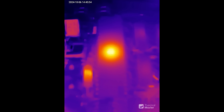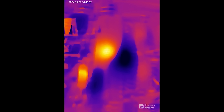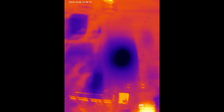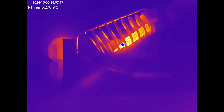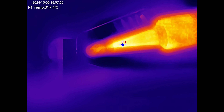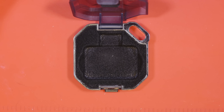A couple of strange things happened while I was testing. One: I had a bug where the camera kind of flashed and burned an image on which didn't go away — I think this is a bug that Thermal Master might want to look into. I had to unplug the camera and plug it back in again to get it to behave. Secondly, I wanted to try the auto temperature range, so I pointed it at my soldering iron as it heated up on auto, and the temperature got stuck at 203.4 degrees C. It was only when I manually changed to the higher temperature range that it caught up and got up to around 300, which is what I had the iron set to. Bringing the iron a bit closer, the tip is getting up to about 320 — I don't know where that disparity comes from, maybe I need to change some emissivity values or maybe it's a problem with my soldering iron.